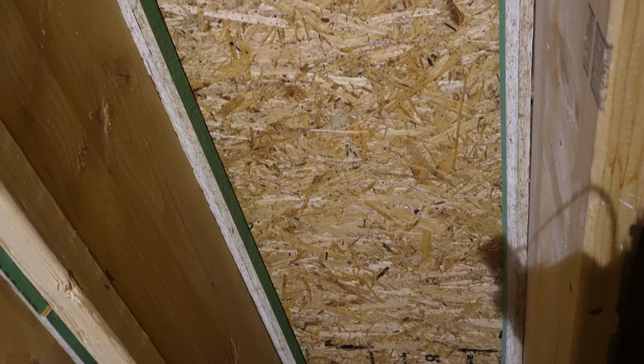This is the attic knee wall that's up against that little spot right there, and that's fully insulated with R23. This will be air sealed with Siga Majvest and Fentrim around the window, and even at this bottom joint here, I'll either seal the sill against the subfloor with some Lexel or use the Siga tape and fold it down onto the subfloor. So there should not be any air leakage to that unconditioned space. Using up the R38 scraps in the attic spaces should at least keep them somewhat temperate for storage.